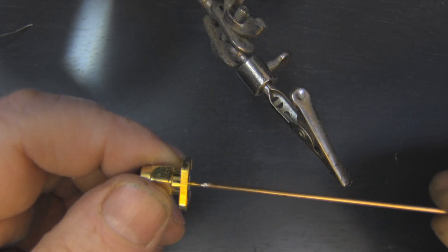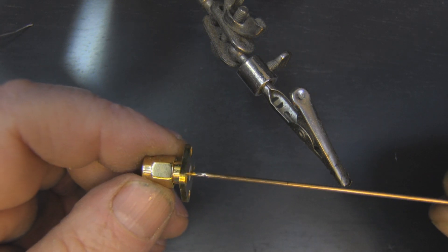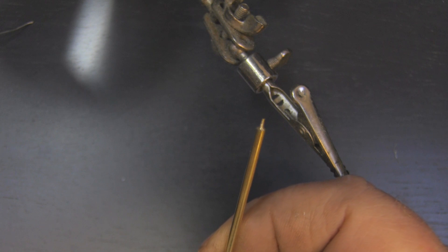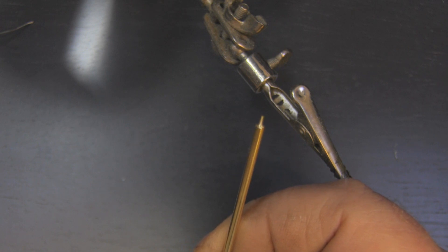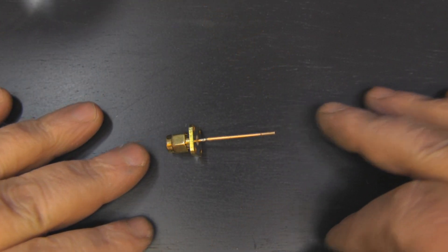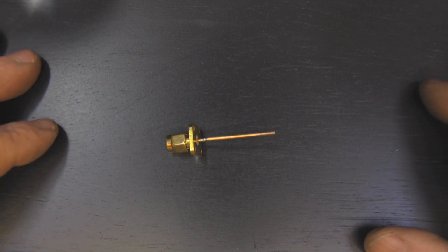If you need to, you can get in there with a file and clean any excess solder off. But now that is a really, really good strong joint. It's also the same method I use with the wider stuff — this is 2.3mm thick brass brazing rod — same principle using that grinding disc just to take it down to a nice straight even peg, not a spike. You get a really good solder joint. Here's the finished driven element cut to the right size for 2.4GHz. Hopefully you found this useful and will join me on the next one.